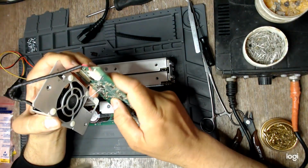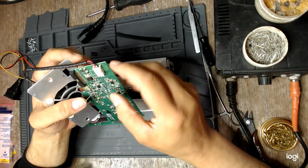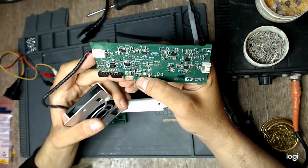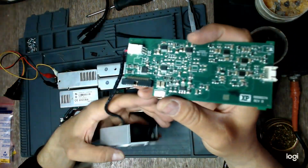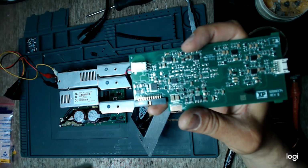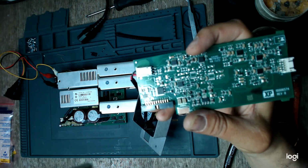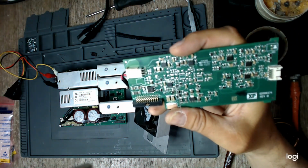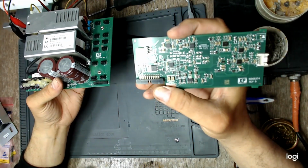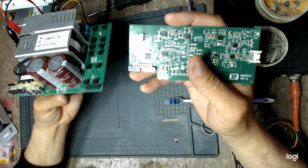So why did that one fail? What on earth? I honestly have no idea why. It is the same voltage Zener diode, the same polarity, the same pinout, just a different code. Why is this one working, but that one is not? I have no idea. I did check under the microscope to make sure all the solder joints are okay. And this time, everything seems okay. So why did this diode not fail?